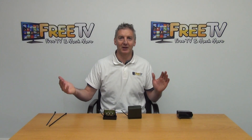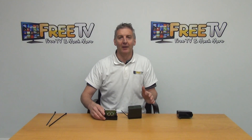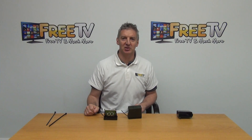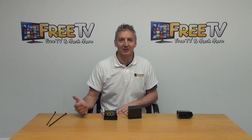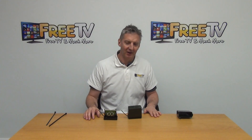In certain circumstances this provides you with the ability to put up two aerials, run them into a single combiner like this — a diplexer — and what you have then is a single cable that runs from there. You can run it into a TV distribution system or directly to your TV, and it will allow you to have both Freeview and Saorview on a single cable as if it's a single feed coming in.